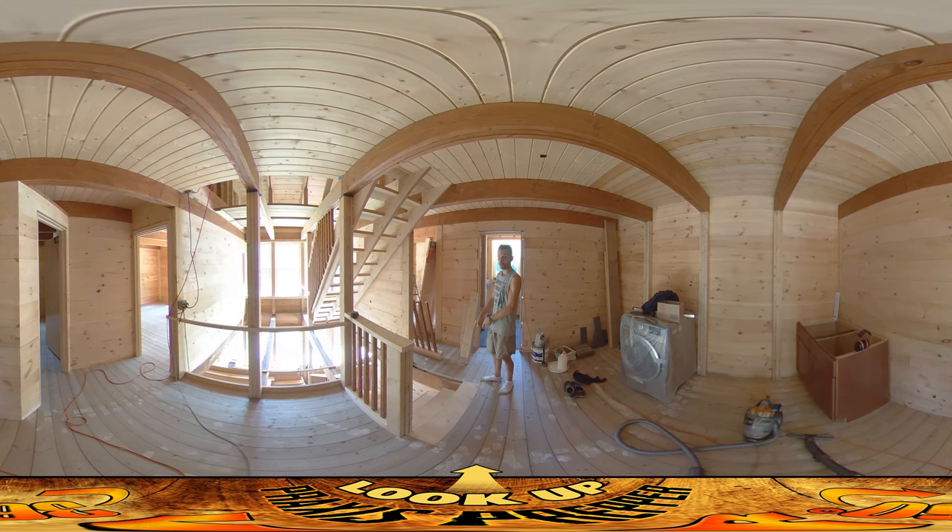This one's a little bit different because it's going to have some switches in the post. There are going to be switches set right into there, and they're involved in a six-way wiring setup that is kind of the more complicated wiring setup we have for the whole house. What it's for is so that you can turn lights on and off, and all the switches will control one set of lights.